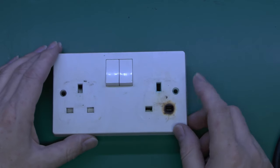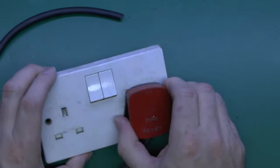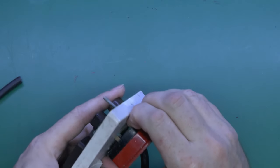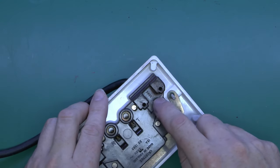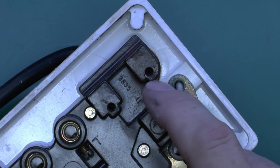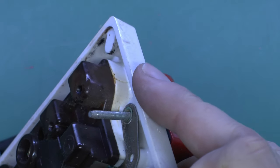Now, this is bad enough, but of course what happens when you then take the damaged and busted plug out of here that was overheating and put it in another socket somewhere else? Well, the answer is this happens, and what's happened here is that it's damaged to such an extent you can't actually get the plug out because it's actually seized in. And if you look on the back here you'll see the damaged parts on the corner, and it's somewhat discoloured. Here's a close look at the back and you see it's actually melting the back plastic here, brown in this case, and it's actually breaking away at the sides, it's all discoloured and horrible.